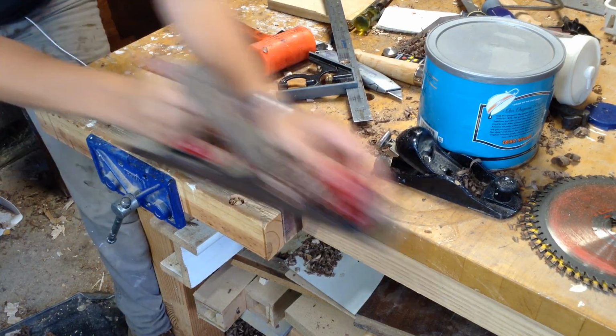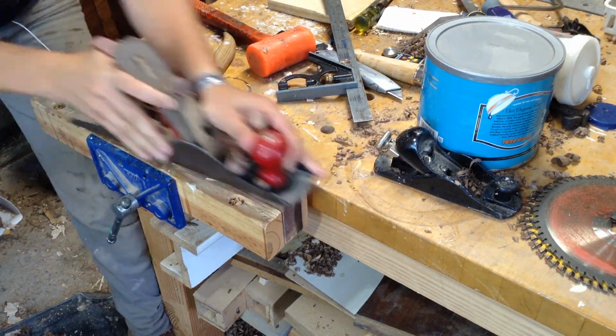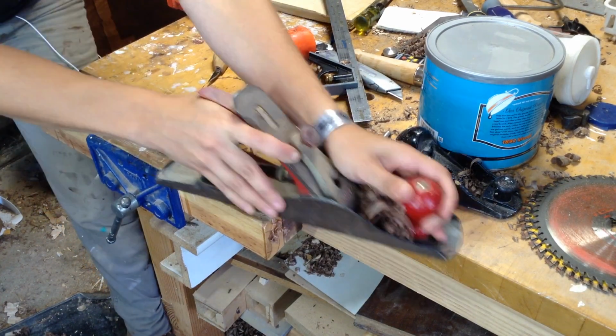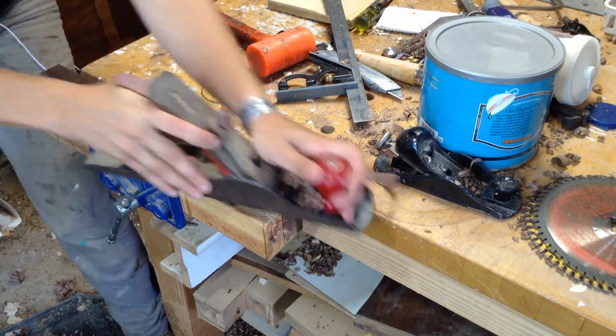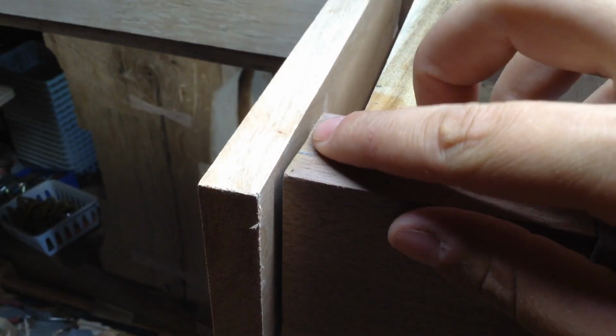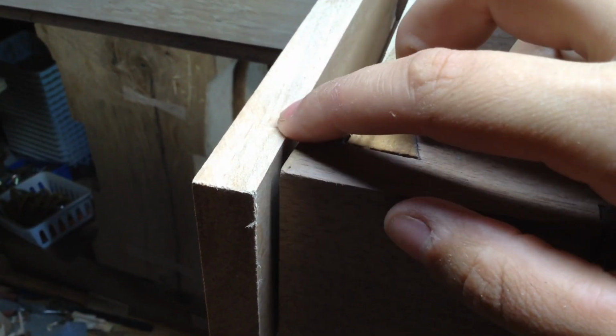So this drawer I needed to shave about a 1/16 to an 1/8 of an inch off the top so that there's a reveal at the top and it doesn't drag across the tabletop. And then I'm going about, this is a little over an inch thick, and I'm going about 7/8 of an inch deep. So I marked that, and then I could trim down the maple to size.